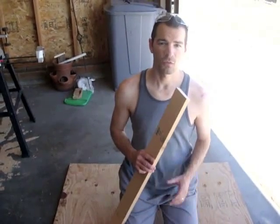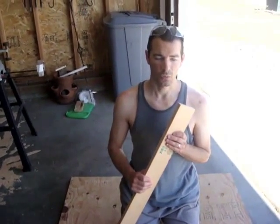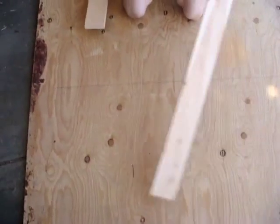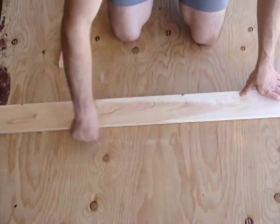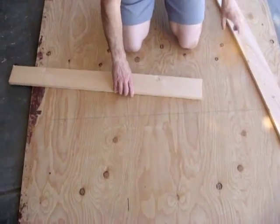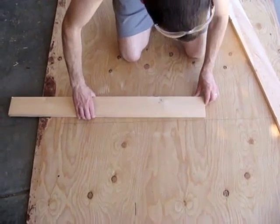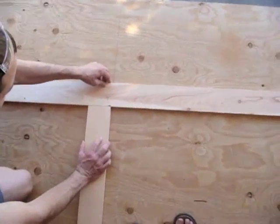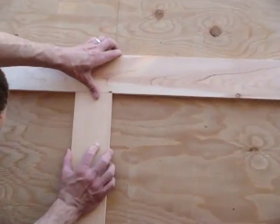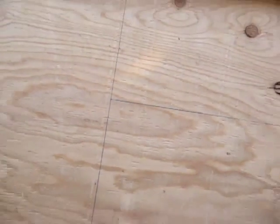We got our outer boards cut for the cover. I don't have a right angle or a T-square, so what I've done is taken a piece of plywood with a nice straight edge on one of the boards, set it down, and drew with a pencil on the plywood. When I cut my board on the miter saw, I know it's a good right angle. I lined this edge of the board up with our line and made sure it was nice and flat, which gives us a nice 90-degree angle to line up our boards when we're putting the cover together.